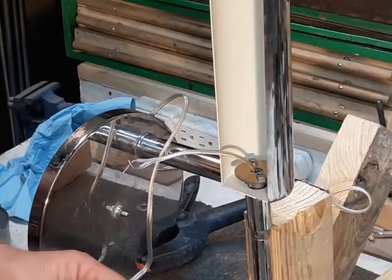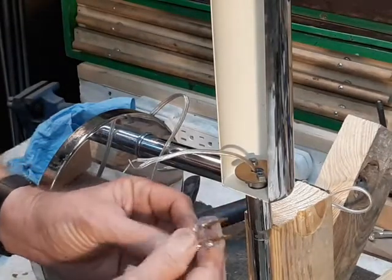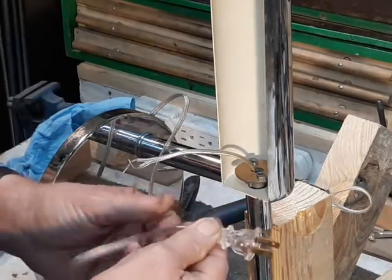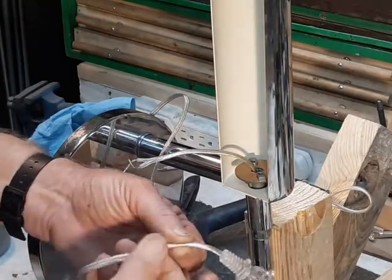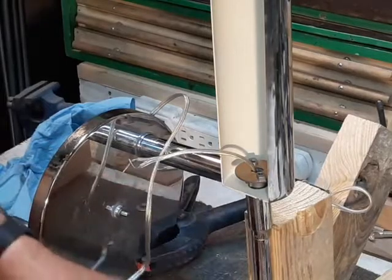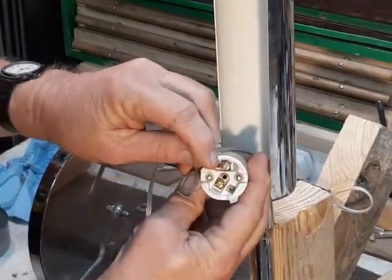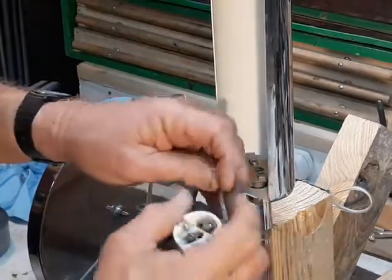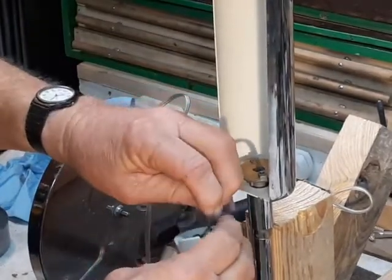We will return to the sermon of the lamp, which I repeat in every lamp video because it's that important. In the United States, all plugs intended to be used for lighting have a wide prong and a narrow prong — that's so they can only go into the outlet one direction. The wide prong goes to the wire on this side, which actually has ridges that you can feel with your fingers. The narrow prong goes to the smooth side. And this is a matter of personal safety in the home — getting electrocuted and stuff like that, which nobody really wants.